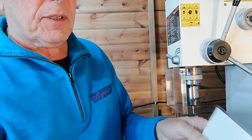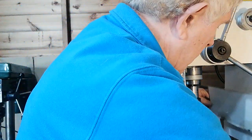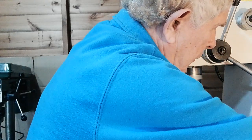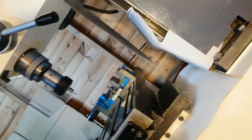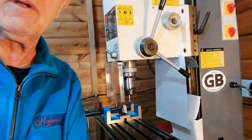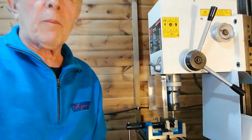All I did was cut another piece — not actually card but a laminated card. It doesn't matter what it is, as long as it's laminated; the lamination gives it a bit more rigidity. I cut that to shape to go over and fit roughly underneath there. It fits underneath and stops the swarf coming along there, making it a lot easier to clean up. All you simply do is get the swarf off with a brush — it's easy to clean. That's a nice little hint.